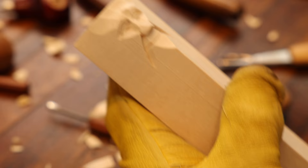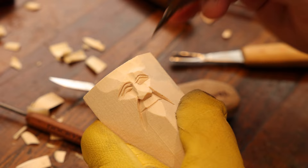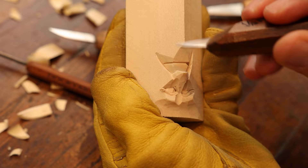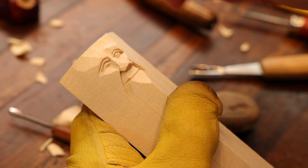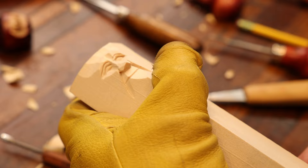I'm going to turn my wood and come in and finish out that there. Now we're going to take our knife and make six cuts to each eyeball — six cuts to each eyeball. It's going to be kind of a triangle cut, and the deepest part of your eye is right next to the nose near the teardrop. Put our stop cut there, stop cut number two, and the last one. Angle your blade and remove that out. Now we need to set that eyeball back into the socket area of the eye, using just the very tip of the knife. Don't use the whole blade — just the very tip. Put a stop cut on top of that eyeball, then take your blade and go right in. See how that made that shadow there in the eye socket.